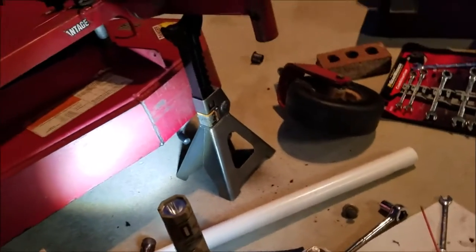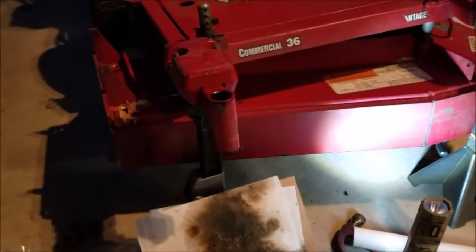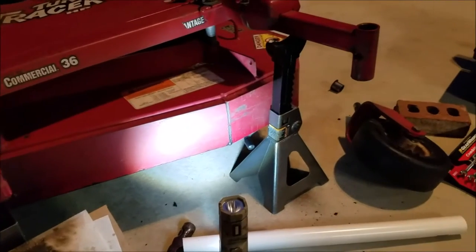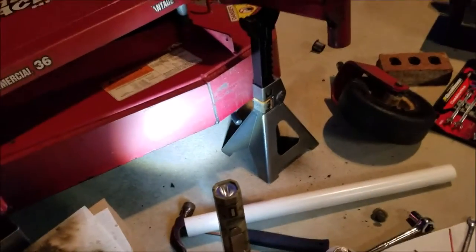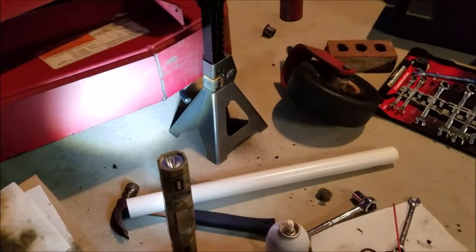That's what's going on right now. I just need to finish cleaning this out on this side, then do the other side and clean out the grease ports - should be good to go. It's going pretty good so far. I started just doing it with a hammer and punch to drive out those bushings but it wasn't moving, so I decided to do it real carefully with my air chisel.